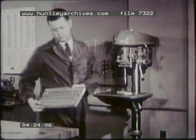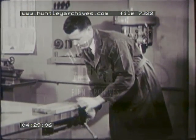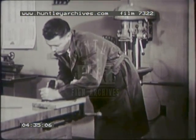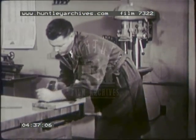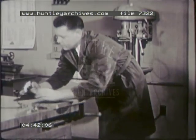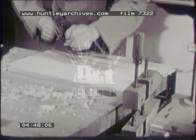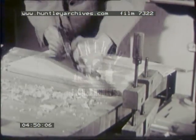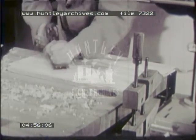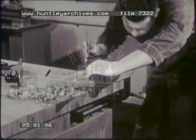Select the better side or face. This will be the working face. Secure the stock for planing. Plane the surface with the grain, planing off the high spots first. Check the piece frequently using a square held on edge. On wide or glued-up stock, it may be advisable to plane across the grain in order to get the surface smooth. When this first surface is smooth, mark it working face.